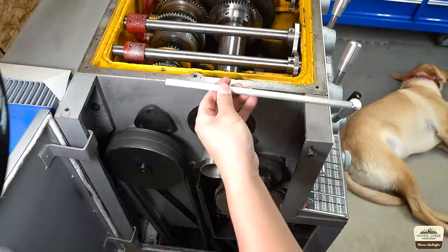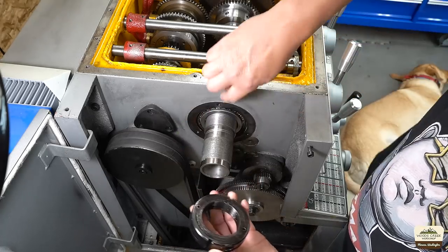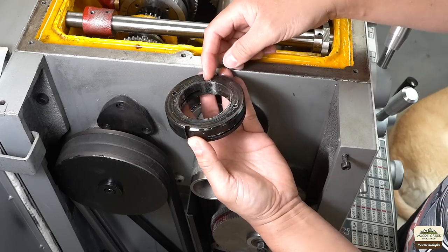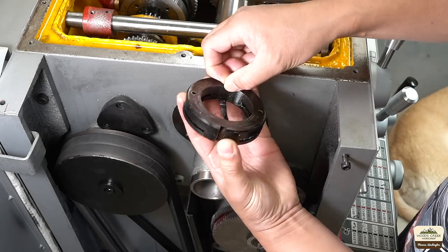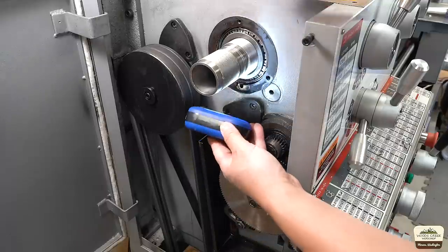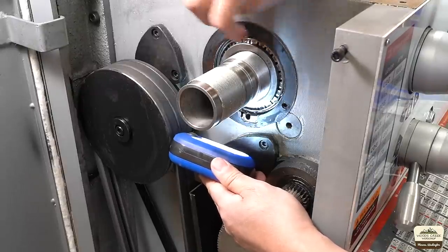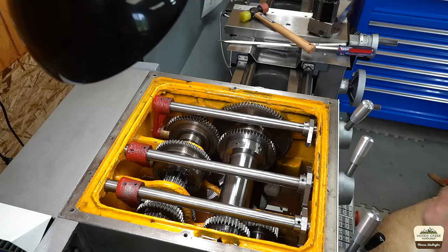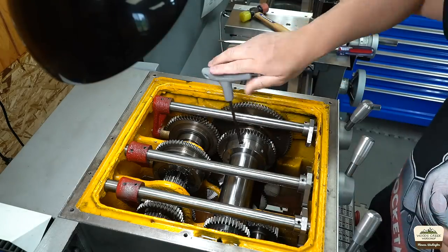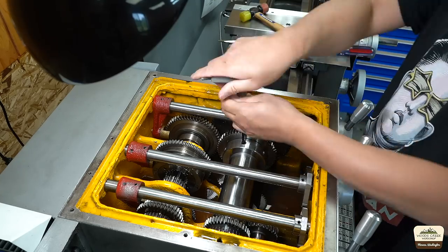This is aluminum rod — don't try it with a cold chisel or something hard. It's pretty rough and that's the surface that pushes on the bearing. There's metal sticking out from threading; it should be lapped before I put it back on. That hole right there is where the oil drains back into the headstock. There are two holes, and the way they placed the gasket, they're covering up one of the holes. Now we need to loosen that collar — there are two set screws, and underneath them are brass or copper plugs so the set screws don't mar up the thread.